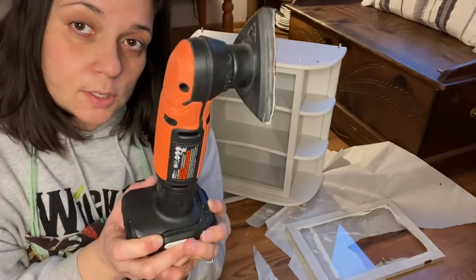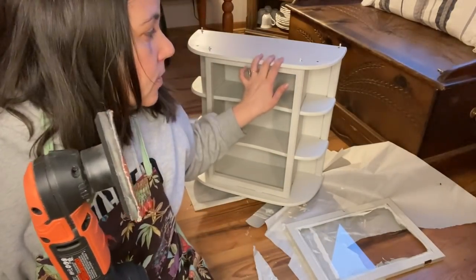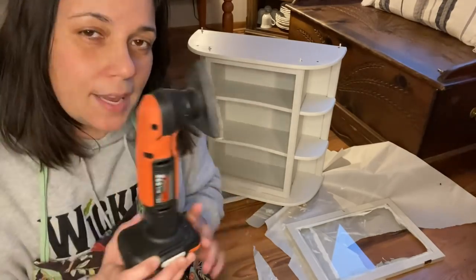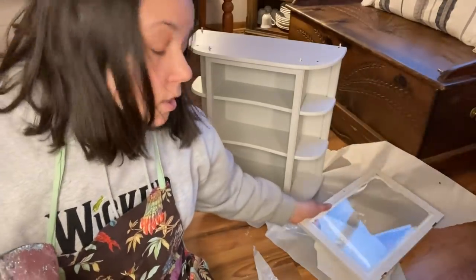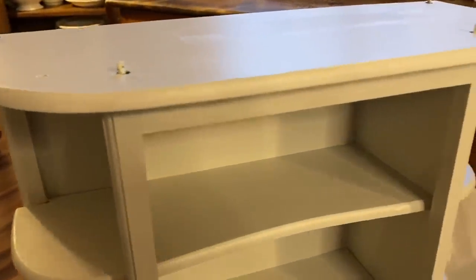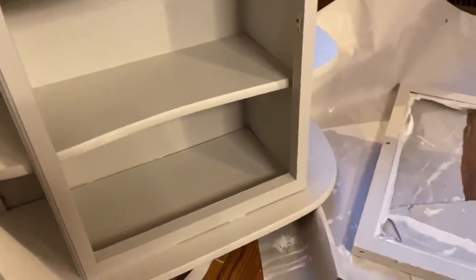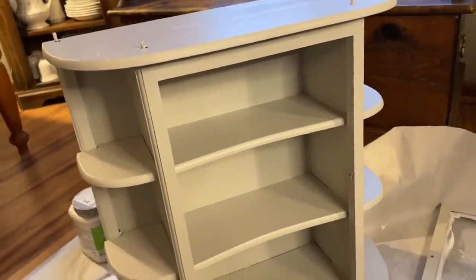This is what I use to rough it up a little. Sometimes I'll use a wet rag method, but since it's the next day the paint is pretty well cured, so I'm going to go ahead and sand it. Here is the top coat before I rough it up — the latex paint gave a really nice finish. The foam brush does a great job. There's paint on the glass but I'll take care of that later with a razor blade.